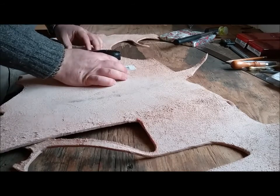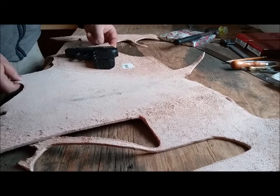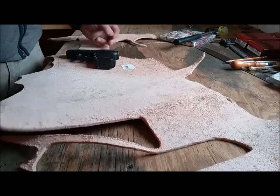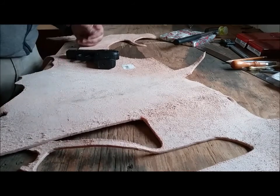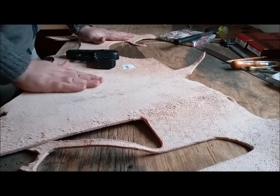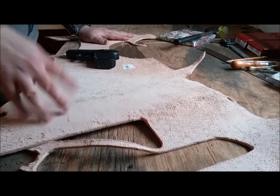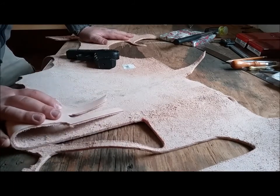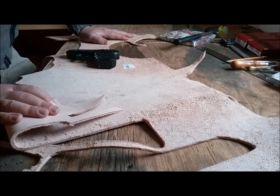What I do is I lay the gun down. Since this is going to be a right-handed holster, I'm marking on the suede side, which will be the side close to your body. The skin side gets really sticky if you don't have an undershirt on and it's not comfortable. So if you go with the suede side, it's nice and smooth and soft and even if it gets wet, it stays nice and smooth and soft. It's also technically better to have the skin side resting on your gun rather than the suede side, because the suede side will hold water better and the skin side repels it better.